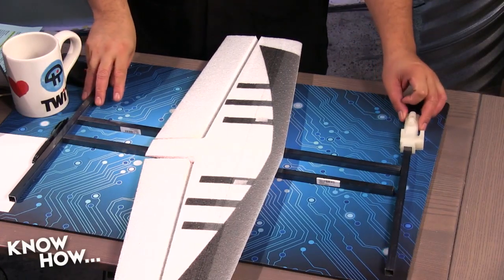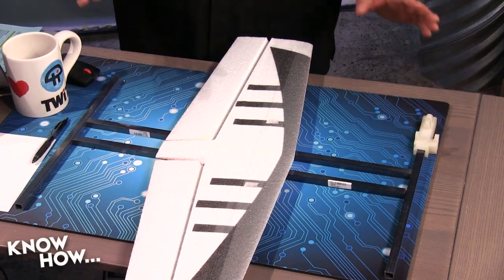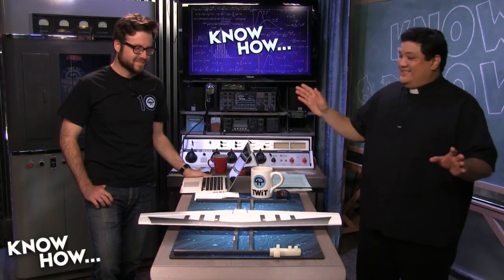The tricky part, and this is something that I do want to go through the custom firmware for, I want to see what happens during that transition. Because during the transition, you're switching controls. Right. Because in a quadcopter, on the right stick, you push forward and it goes forward, back goes back, left and right. And on the left stick, it's throttle and then yaw. Your amount of thrust, yeah. When you switch to aircraft, when you push forward, it makes it dive. So I don't want to be going forward, start transitioning, and then it just nosedives into the ground. We'll see. Yeah, that seems a little tricky.